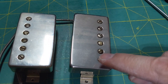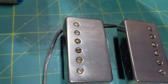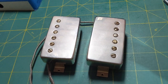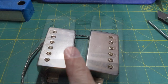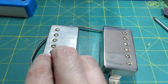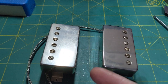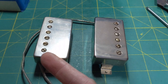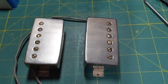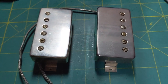I changed the covers and ended up changing the pole pieces as well. The other pole pieces were fine, but these are a slightly aged pole screw so they don't look as brand new — it fits with the throwback covers. The bridge is slightly lower output than the neck: bridge is around 8.2k and the neck is around 8.5k. That's not too uncommon — vintage PAFs often had a higher neck output than the bridge — but I'm sure they'll balance out fine with pickup height adjustment.